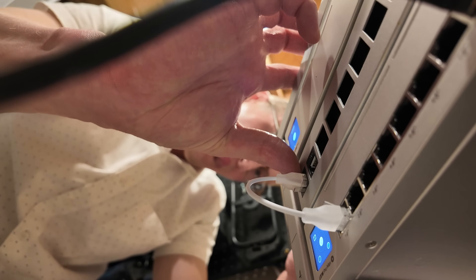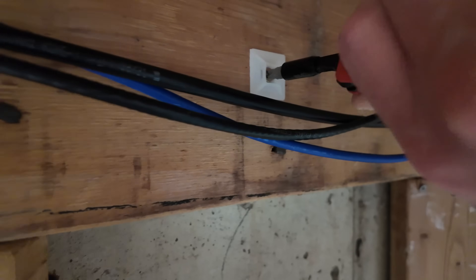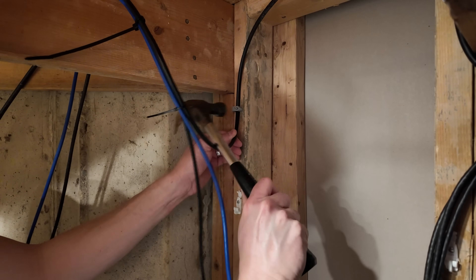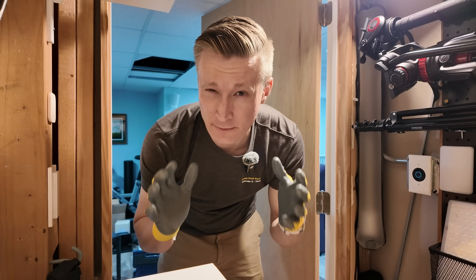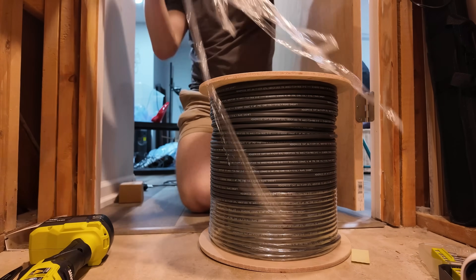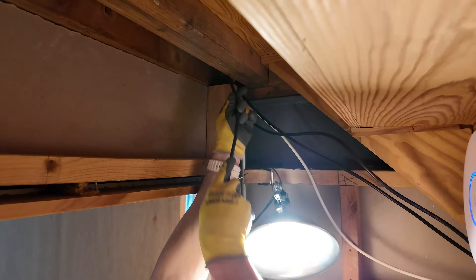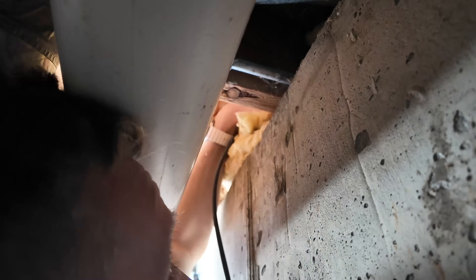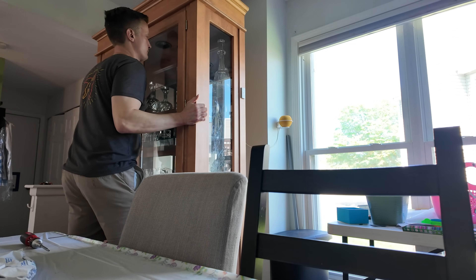The server closet remodel is coming along — more and more stuff is going into the patch panel. There's one big problem we still need to deal with, and it's kind of heavy: CAT 6A cable. I have a bunch of CAT 5E and cable that's just not performing well enough to deliver more than gigabit speeds to my dining room where I want to put a Wi-Fi 7 access point. We need to run CAT 6A to get faster, better-performing cable up there and future-proof that setup.